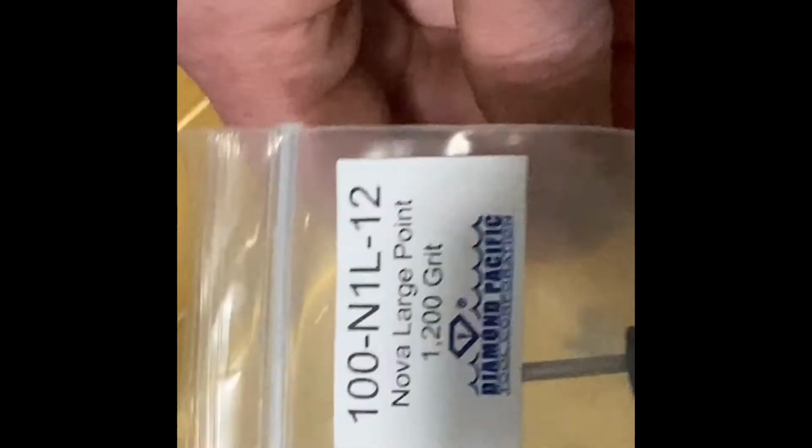You know, this 280 grit will take out those scratches really well. You might have to do a fair bit of grinding, but you'll get them out, and then you can move to the 600. 600 will really give it a bit of a polish and move up from that rough sort of look, and then you're getting into more of a polish with this 1200. Then you're getting into a fine glassy polish look with this 3000 and then the 8000.